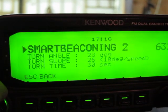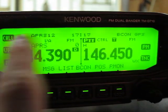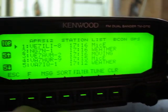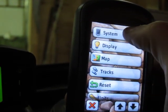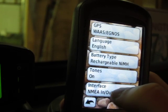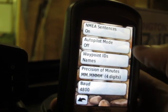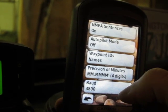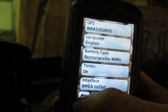Let's go to the main menu. So for the Garmin setup, this is pretty easy. We'll go to setup, then system, then interface. The interface is NMEA in and out. You have NMEA sentences, autopilot mode off, waypoint, precision is four digits, and baud rate is 4800. Important to be 4800, not 9600. And that's all you need to do on your Garmin to start receiving information.